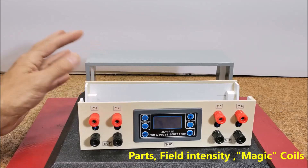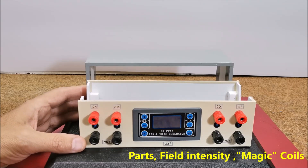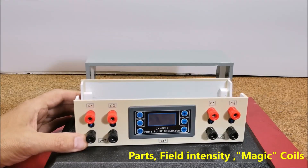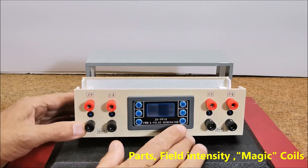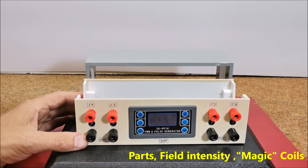In the appendix at the end you can see that there are two similar circuits. In one, a potentiometer has been added which can be used to continuously regulate the flux from zero to maximum. In my practical device I have omitted the potentiometer for simplicity, and the intensity of the magnetic field can be partially changed by changing the duty cycle in the range of 5 to 30%, although the standard value of the duty cycle should be around 10%.